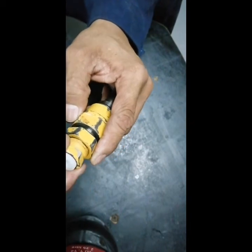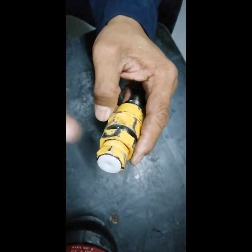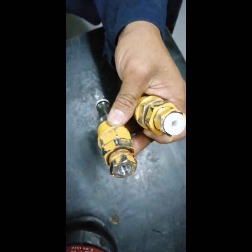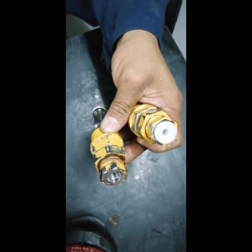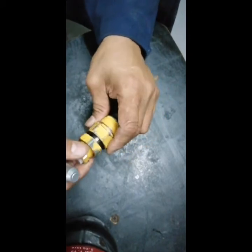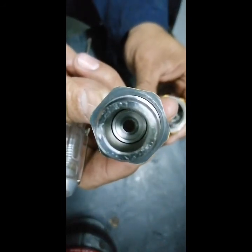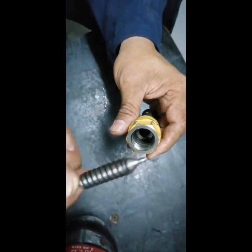This is a simple part with a lock nut, attached to the control valve. You need a 32, 30, and 24 spanner. The hoses on this side go to the two-stage solenoid, and the other hose also goes to the two-stage solenoid, which has a two-way Y-connector up there. Inside, the only components are a small o-ring, a needle, a spring, and one small spool.